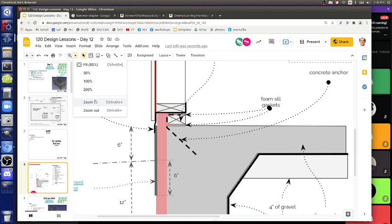There are pieces of the styrofoam insulation at the site, so what we can do there is take the factory edge and just use the razor knife to cut that. One edge is going to be factory cut, the other one is going to be razor cut, or we can put it on the table saw to get a straight cut. We can do fine with the razor: just use a long ruler or board against it, cut against it and then break it.